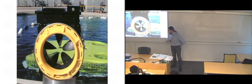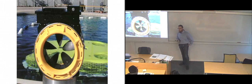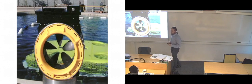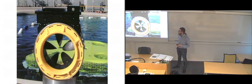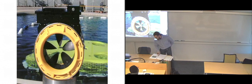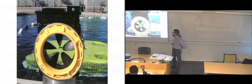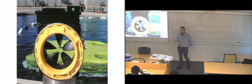So you've probably seen transformer stations around everywhere. These small electrical houses that are receiving quite high voltage power from the main lines, and then they are transforming it down to the 240 volts that we have in our wall sockets and distributing it to the local houses. So basically that's the same that's happening in the transformer inside the ROV. So it's getting a high voltage current that's coming from the supply vessel, and then it's transforming it down to the correct levels for the components inside the ROV. And by doing this, you can even reduce the thickness of the cables that you need, because you don't need that thick cables to have efficient energy transfer. So you get a lot of positives from developing the electrical ROVs.